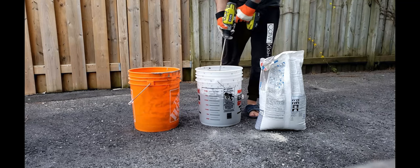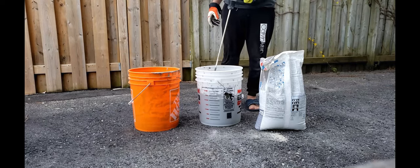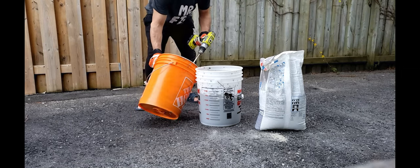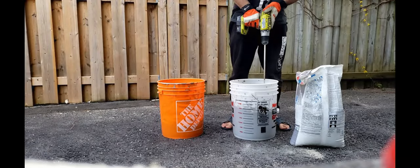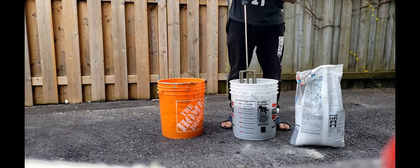It is always nice to have a clean bucket of water to wash your mixing paddle. It helps to remove any cement that may dry out during the waiting period. Do not add any water once you have mixed your cement and are waiting the additional 1 minute before mixing again. Only mix as much as you think you may need. A good rule of thumb: half a bag gave me enough working time.